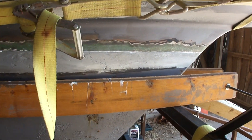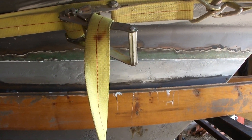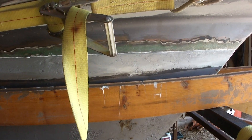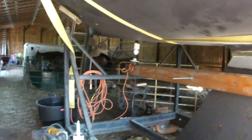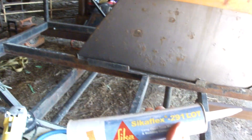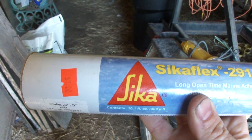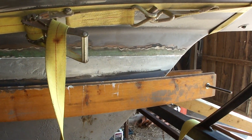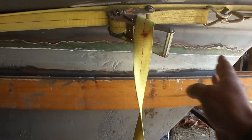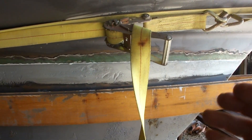It's a Johnson laser, but it worked really well. We had a gap of maybe two inches between the two surfaces. We set it down, made sure everything was true, brought it back up, and then applied Sikaflex 291 — the long open time version. We read that eight tubes are typically used, but we ended up only using four tubes, putting them around every nut and basically covering the whole base.